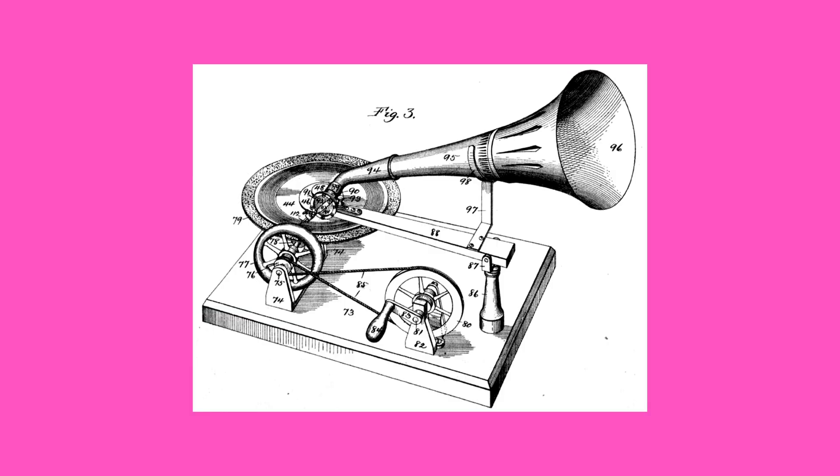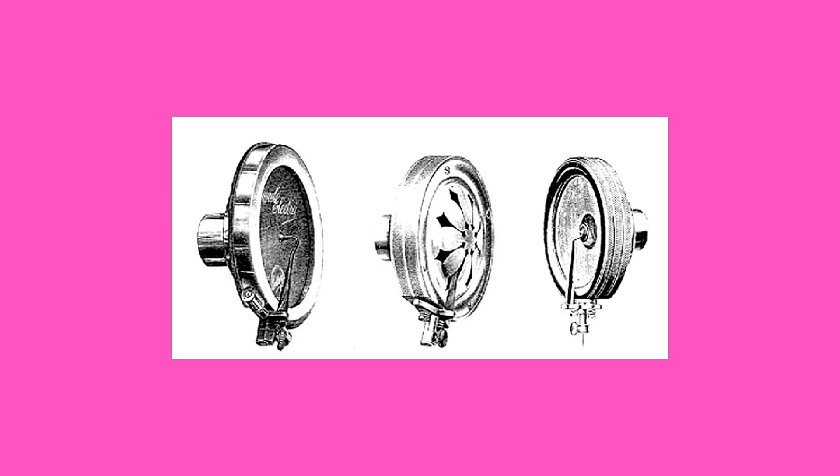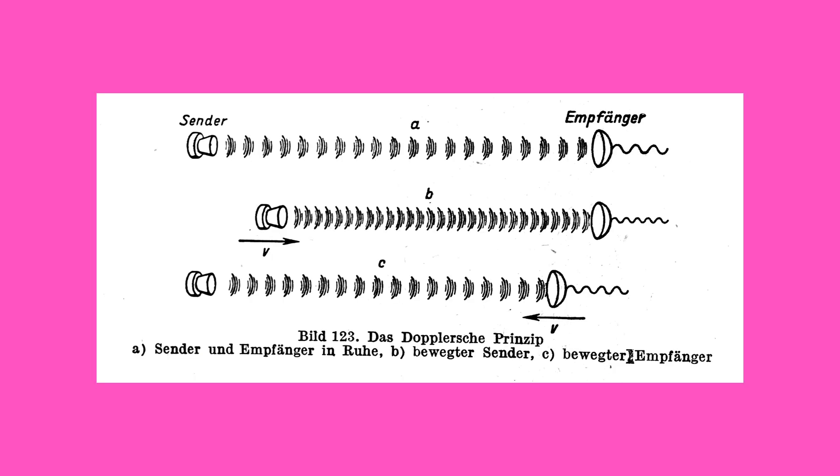These waves are mechanically captured in grooves in a recording medium such as a phonograph record. When we look at the first phonographs and gramophones, we notice that they have a horn for sound reproduction. A needle moves along the grooves and transmits the sound waves to a sound box, which is directed to the listener by a sound horn. The sound box or reproducer is a membrane that is oscillated by the stylus driving along the grooves of the record. The vibrations are carried through the medium of air from the sound box to the listener. We then perceive these waves as sounds.